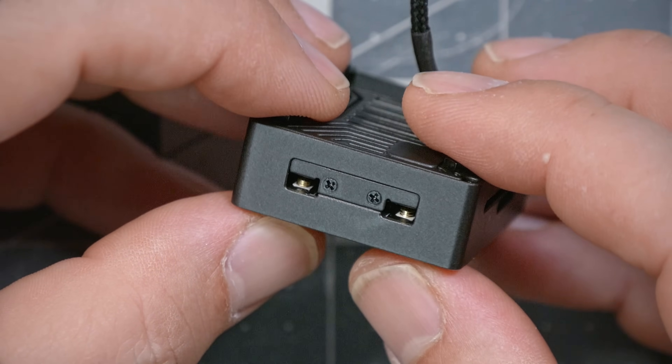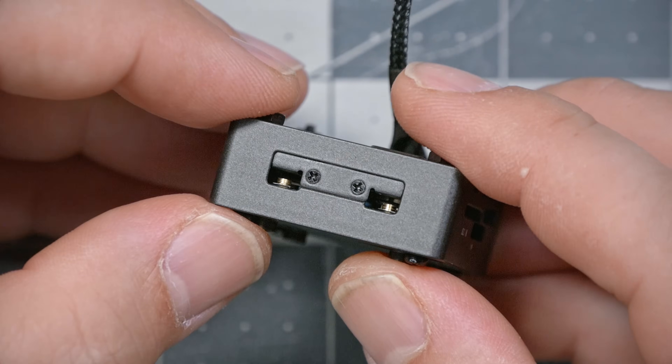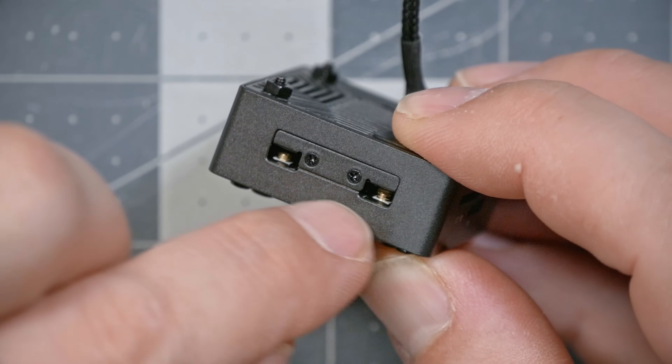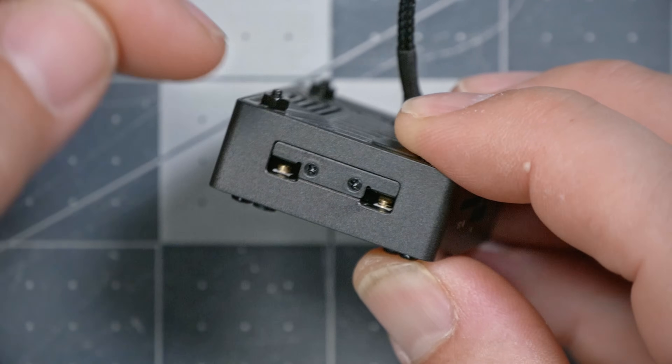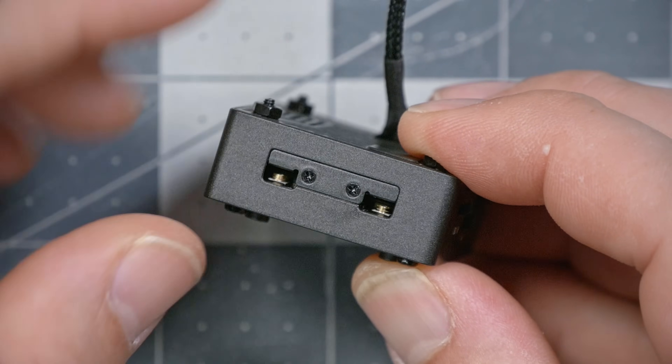You can't really solder to these just by coming over the top like you could with the old one. You would need to open it up, so you're going to be using a plug for this one, most likely. The antenna connectors now come out the center of the board, which is going to make them a little harder to pop on. You'll probably need to get in there with the tip of a screwdriver. The reason is that they have divided the RF amplifier and the rest of the video transmitter into separate boards, so the RF amplifier is here and the antennas come out the middle now.